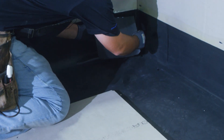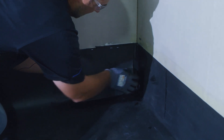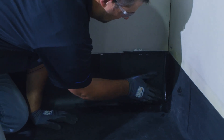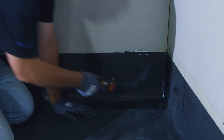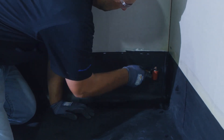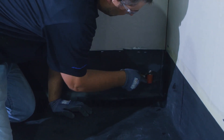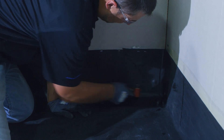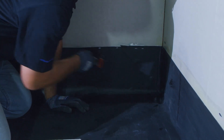I pre-cut this right to the top of the flashing, hold this into here, put this right into place, and roll the cover tape into position to get a good bond.